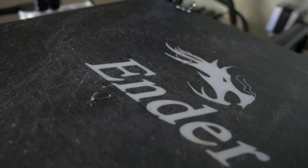Fortunately, the printing surface is replaceable. One of the easiest fixes to both the surface quality and the concave printing bed is using a glass print surface — there are many selling online. If you use a glass printing surface, it will be quite surely flat, so you solve the concavity problem, and being glass, you won't be able to break it just by scraping prints off. As of right now I'm pretty discouraged from using my 3D printer, but as soon as I buy this new printing surface I will start printing again.